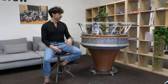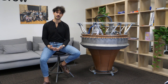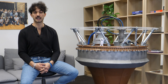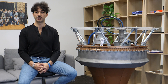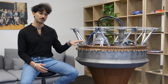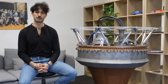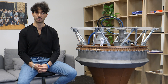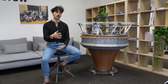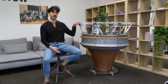First of all, what is this thing next to me? This is an Aerospike engine — in fact, this is Arcos, a 30-ton methane and liquid oxygen Aerospike engine that we are developing right now at Pangea Aerospace. It is based on the heritage of a smaller Aerospike engine, Demo P1 — you can check the video in the description — that we already tested at DLR Lampoldshausen last year. We are using the same technology and heritage from Demo P1 in order to make Arcos a reality.